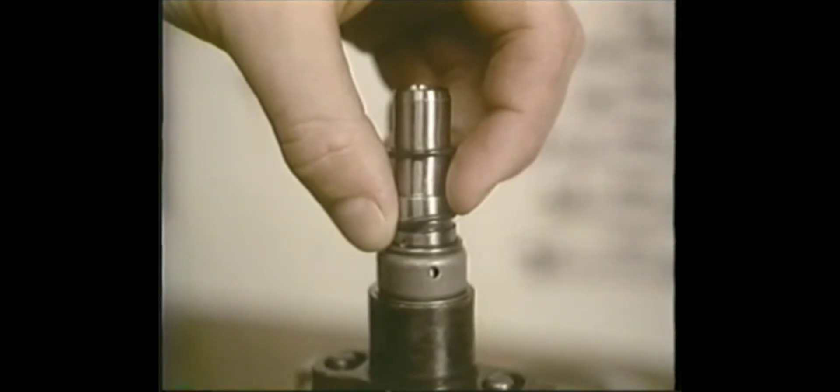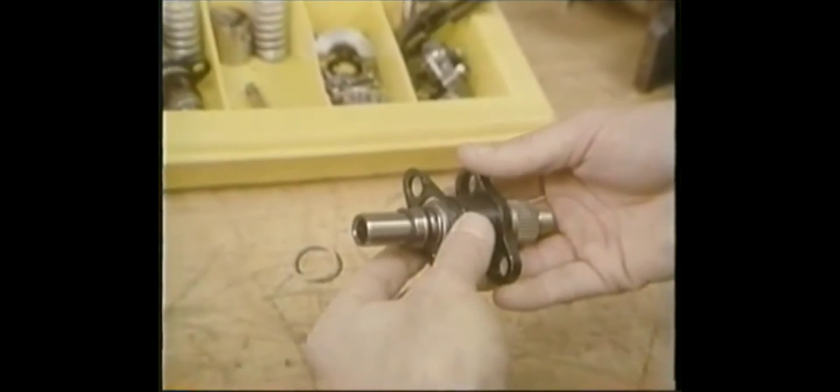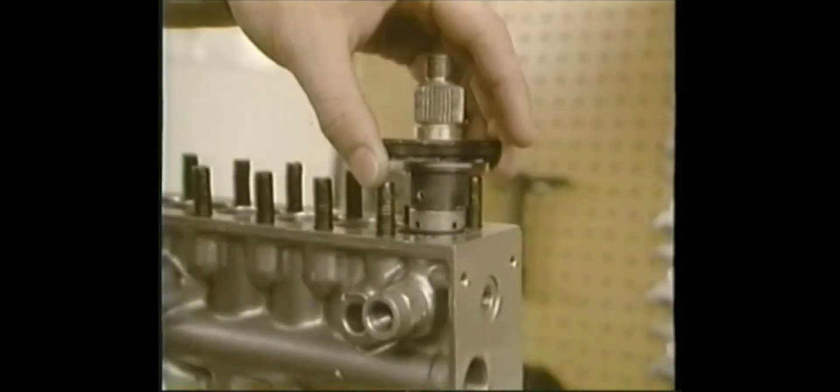Be careful of your fingers. Slide the O-rings into their grooves and return the shims for that particular barrel — keeping track now saves a lot of work later in testing. With the spacer and large O-ring in place, add extra lubrication to all O-rings to avoid pinching. Be sure the locating pin faces you on the rack side as you lower the barrel assembly onto the studs.